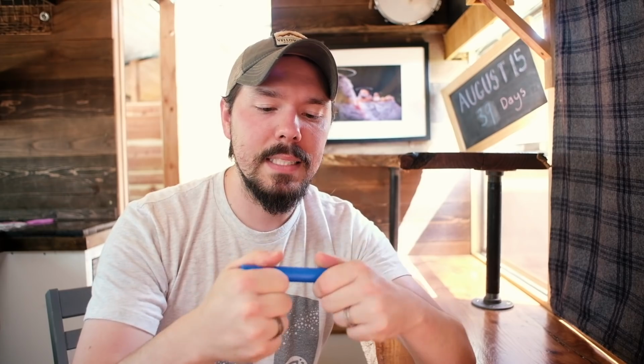So what we've been using has been this 1/2-inch PEX tubing, this stuff right there. It's this flexible, plasticky tubing that is, like I said, flexible. So this is a short piece, so it can't bend very much, but when you have a few feet of it, it can actually maneuver and bend and flex very easily, and it's designed to be able to do that. So if you're in a bus and you're moving around and this stuff wiggles, it's fine. It's not going to start to leak just because of that. So that's why we went with these.